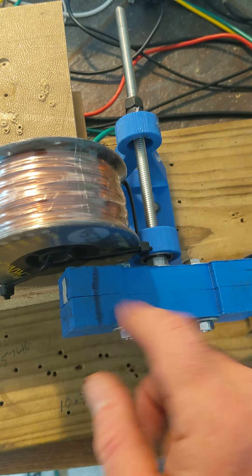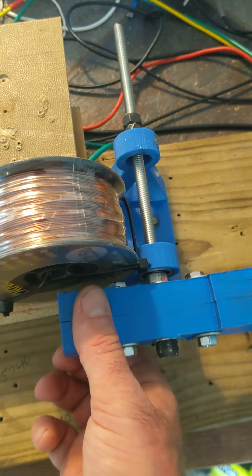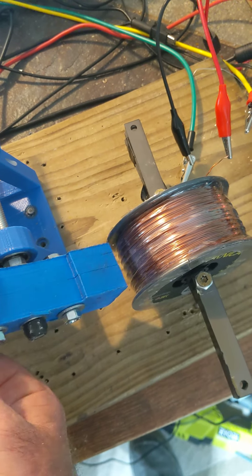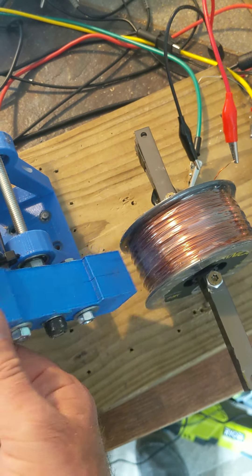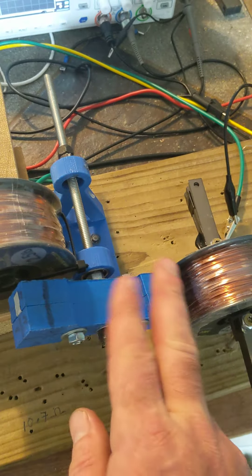So that's a north, that's a south. As one of them goes past — one pole goes past the coil — it induces voltage because it cuts across the wire. At the exact same, or close to the exact same time, the other side goes with the wire on another coil. We're going to do them both ways — to buck and not buck.